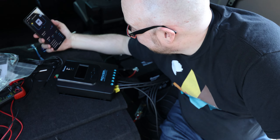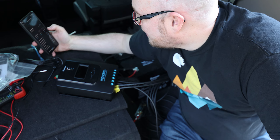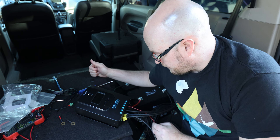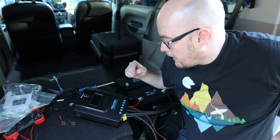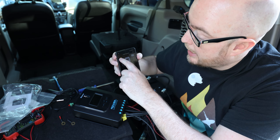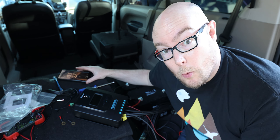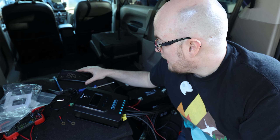Well, we're done! — just kidding. I am really super pleased right now. It's just working. We've got power, and we've got solar power coming in. The app shows solar power coming into the charge controller and the charge controller sending out to the battery. It's getting about 50 watts, which is obviously pretty low, but it is late in the afternoon and the panels are getting the sun at a pretty weak angle, so I wasn't expecting much more than that right now.